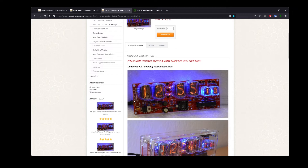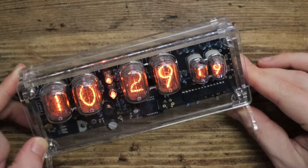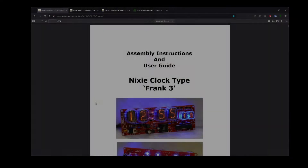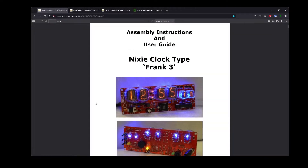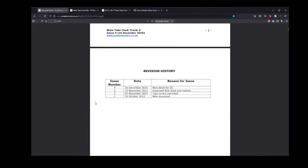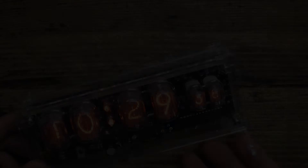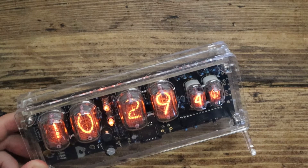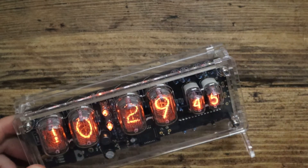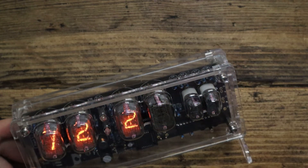This one's got 'Frank' on it — that's kind of the code name for the board. How do we put one of these together? You obviously need the kit, which comes with lots of different parts, and you'll also need the guide — there's a 34-page guide on the website. It's very clear with all the components and instructions. Generally when populating a circuit board you start with the components closest to the surface and build up.